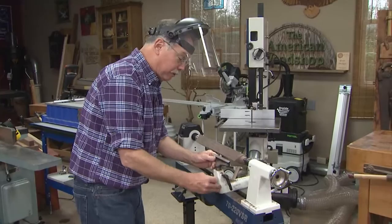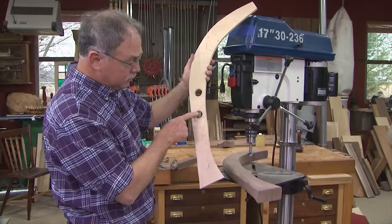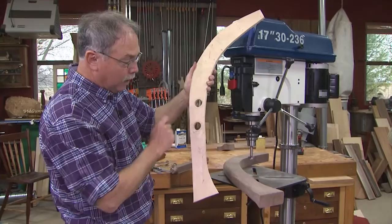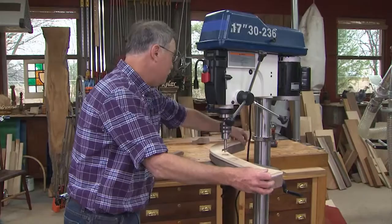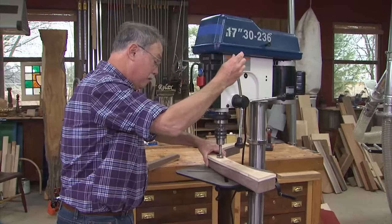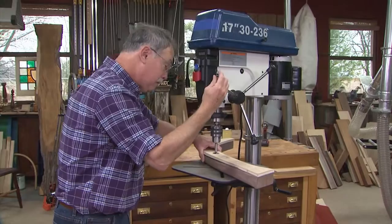This is my layout template. And from this point to that center, it's 14 1/2 inches. The thickness of the slab, then another hole on center, okay, to lock that slab, the cantilever slab. So by using that template with the Forstner bit with it off, lining it up on the bottom and on the top edge, I can then go in and make my hole exactly where it needs to be, press it in, and I did that in both places.